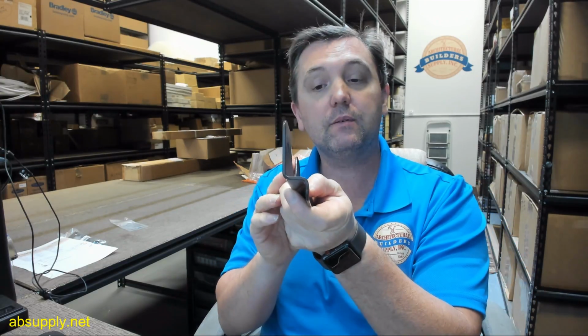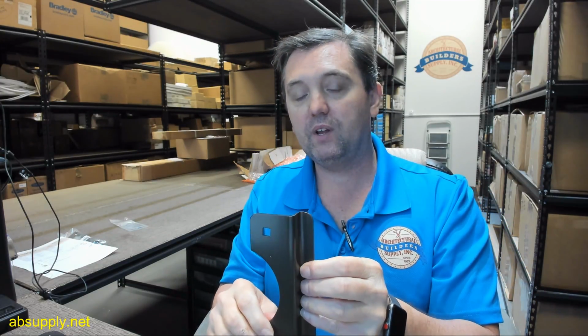And the client will say to me, I don't really want to get in there and chop all that wood out, because maybe it's a trim cap over vinyl or aluminum siding. Maybe it's some sort of treatment like that. So really the most elegant way to go about it is to simply go with an offset. The bottom line is, if you have a condition like what I just described, or maybe it's a center hung door that's set into the frame substantially greater than a typical single acting offset or butt hung installation, you would need to have an offset like this.